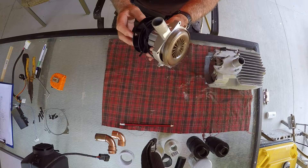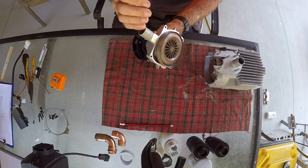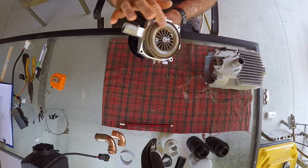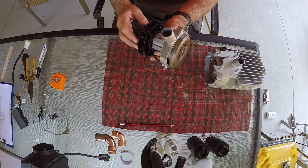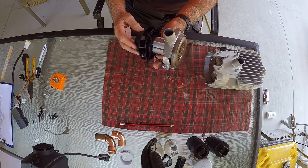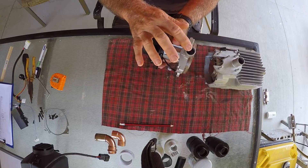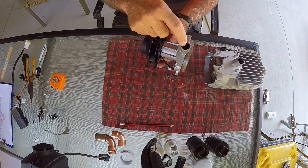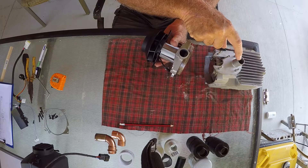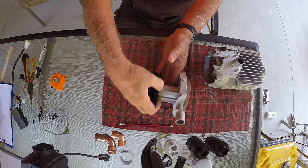It's a non-positive displacement fan - not like pistons in a motor car which actually seal and pull the air in. This fan at maximum runs around 4,000 RPM. Consider that a turbo will run 200,000 RPM or more - over fifty times faster. So any restrictions on the inlet air will restrict the oxygen coming in, which restricts the burn in the chamber, creating smoke and soot build-up.